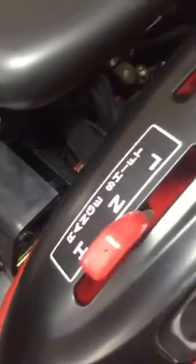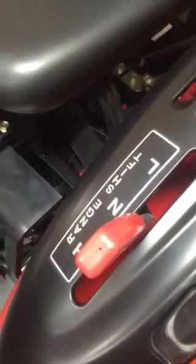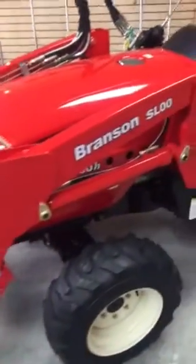It's got a two-range transfer case, so when I get into the heavy clay I put it in super low and this thing will walk out of anything. The front loader is a pin-on, quick-attach loader with a 50-inch bucket and 1,100-pound capacity to full height.